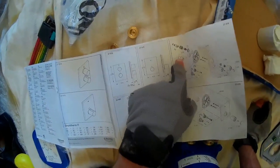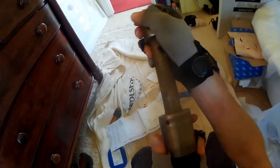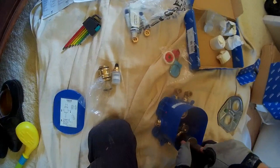And this is the crux of the matter here — this 34mm box spanner. I'm pretty sure an inch and a quarter one would do, but I don't have any of that. I have a three-quarter drive, British Bristol-made one and three-eighths socket here, and I had the driver for it. We're going to stick something in here and just use that to turn it. This isn't the recommended way — you should obviously have the professional Grohe tool. But I tried to get hold of one of those and they're even more difficult to get hold of than the trim set. So I've got something that fits and that's what's going to work.